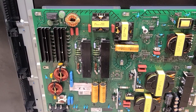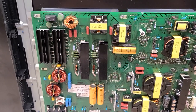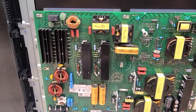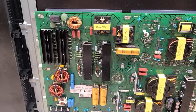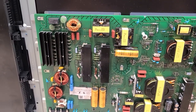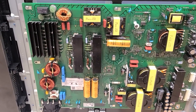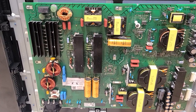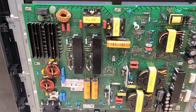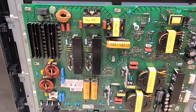We're replacing failed components with the exact same ones. These are fairly new designs by our standards, fairly new production. Many times we're seeing, especially when it comes to power switchers, MOSFETs, ICs with built-in MOSFETs, and SMPS drivers with built-in MOSFETs, that newer generations are worse than older transistors — costing more and failing sooner. We've been using TO-220 packaging transistors for as long as we could find them brand new, and they were way better than anything that comes new.